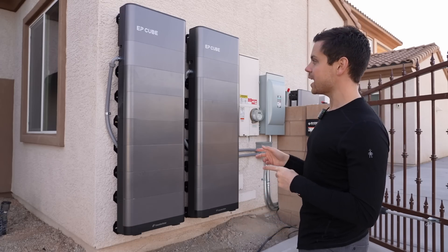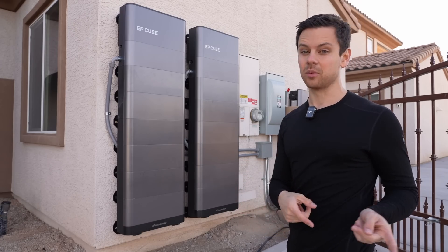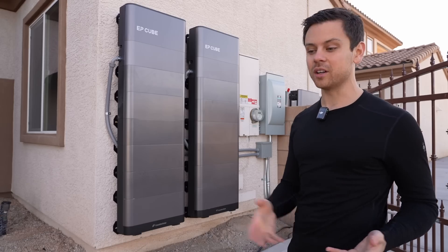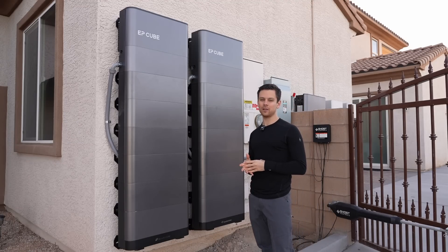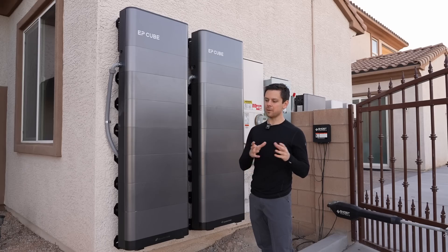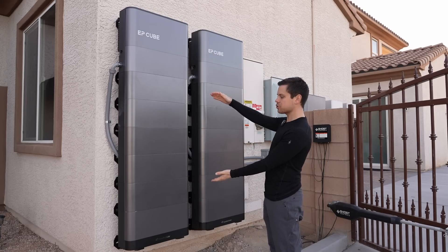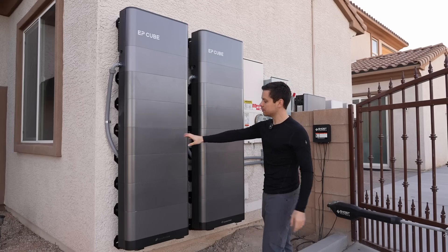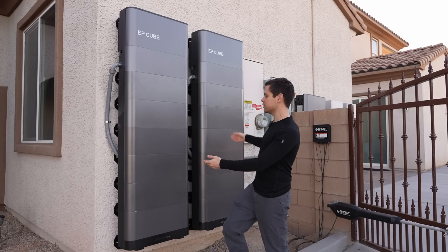It's not a budget system like our other ones, but I think it's the lowest-cost option with these kinds of features. The installation is not that bad for a vertical-mount lithium iron phosphate battery. If you have a Powerwall Plus or similar, those are 300 pounds and very hard to mount on a wall by yourself. But with this system, the modules are 70 pounds each, so one person can install the entire system on their own.